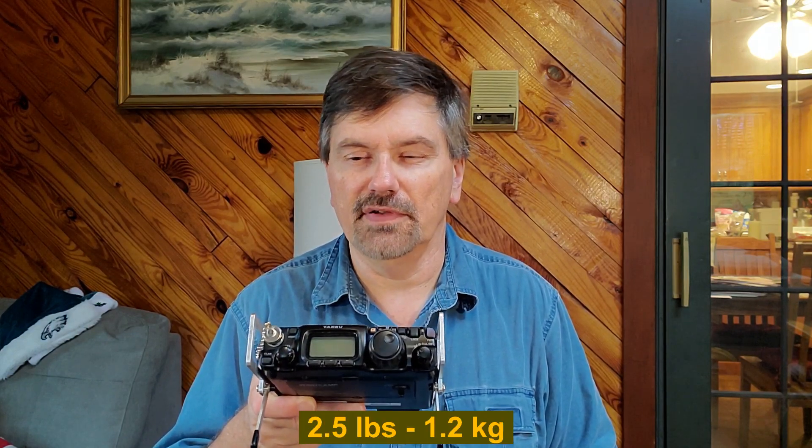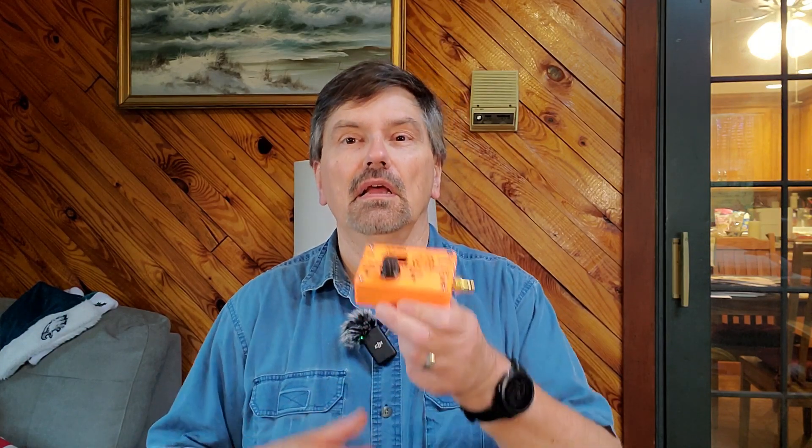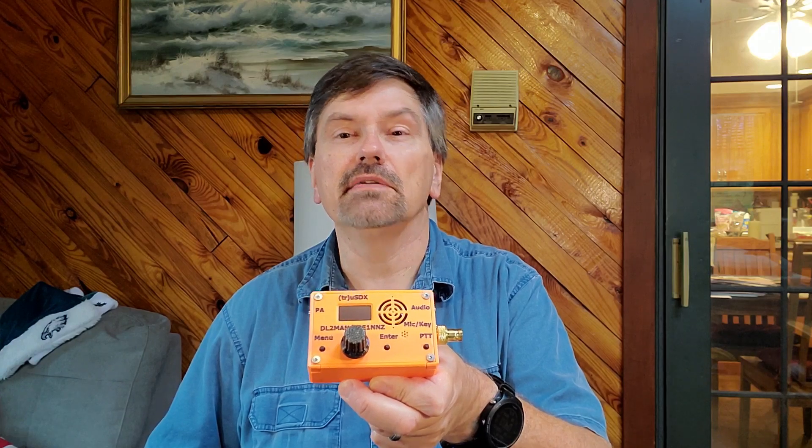When I'm going to be traveling and I know I'll be walking quite a ways, I'll typically bring my QRP radio, which is a Yaesu FT817 — significantly lighter. If you watch my video on what's packed in my QRP go bag, this is the star of the show. It's only a pound or two and draws very low current, so I can use a much lighter battery. If I'm really going to be going up mountains or traveling internationally, I have a TrueSDX and I've used it for two Parks on the Air activations very successfully. On my very first activation at French Creek State Park here in Pennsylvania, I got a Sweden SM3 contact back at five watts across the Atlantic — definitely a capable radio.